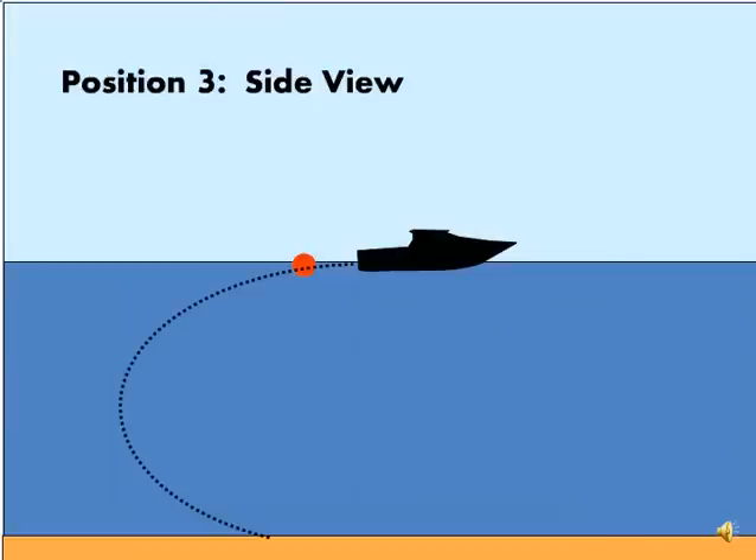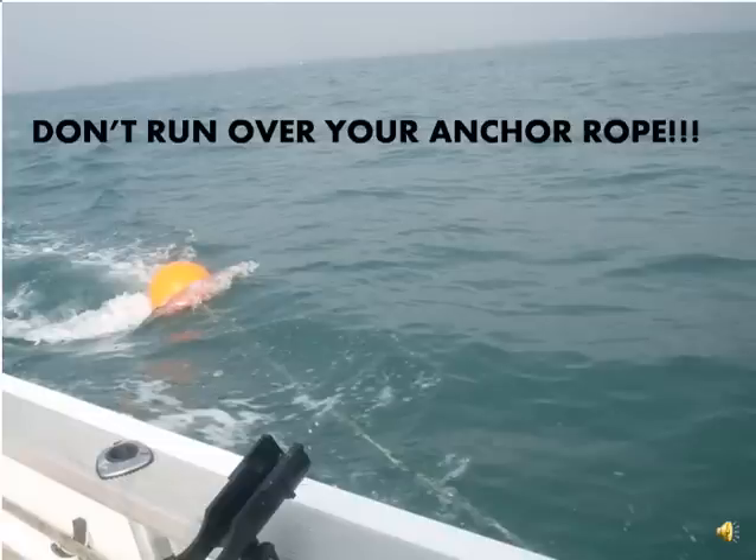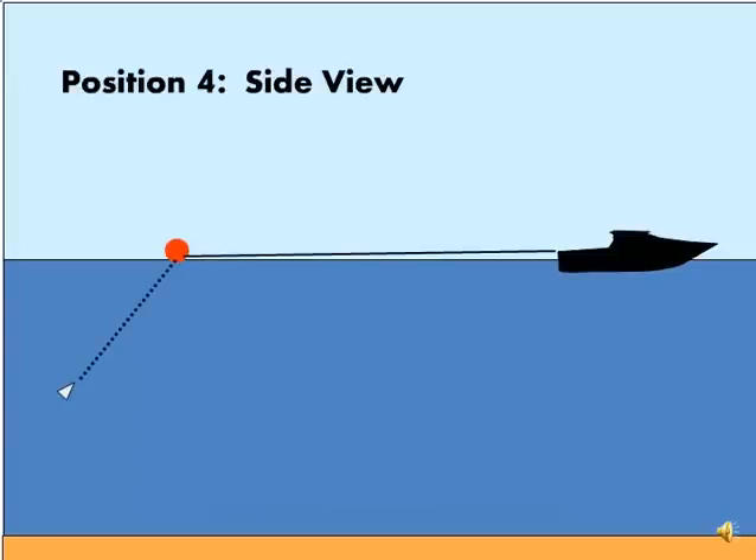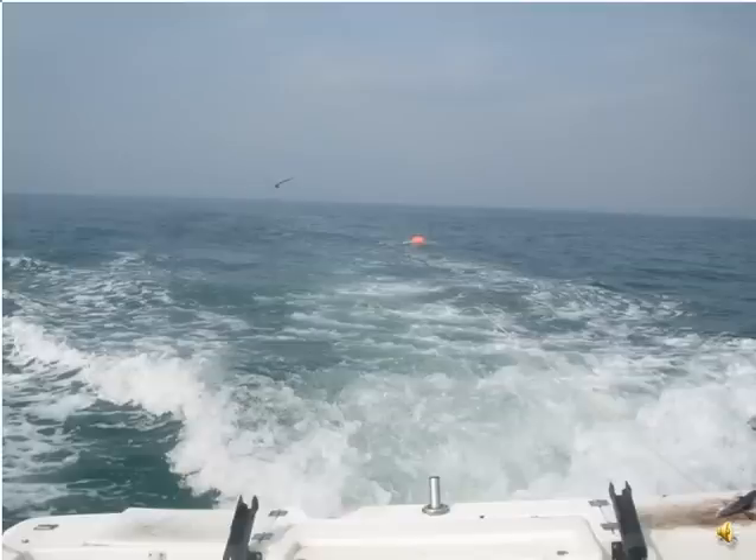This shows that side view again. This is the point where you have to be very careful not to run over the anchor rope. Keep your eye on the buoy and rope as you move forward, as from this point on you'll be towing the buoy as you motor up tide. Continue moving forward in a straight line and you'll notice the buoy duck and bob as the chain reaches the ring and slips through it. If you don't pull the chain through the ring, the anchor will slip back to the seabed and you'll be anchored again. I like to push the throttle down a little at this point, just to make sure the chain runs through the ring.